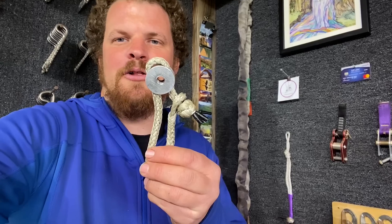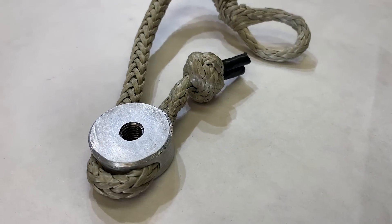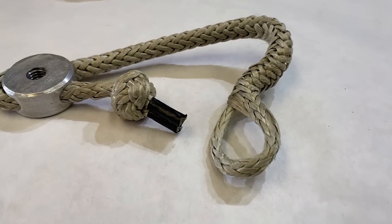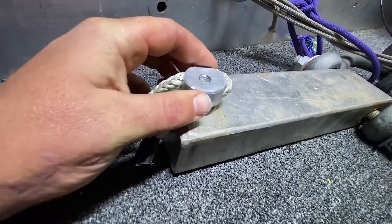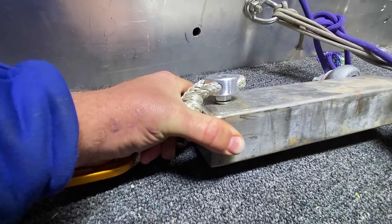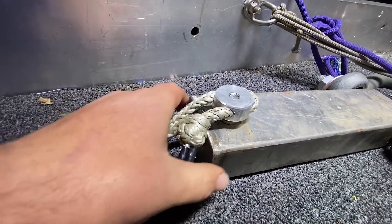So those were the climbing technology caving anchorages — soft anchors. A viewer sent us an alternative. Those of you who have been watching a long time will recognize this as one of Ryan's favorite things. It looks like it is a round aluminum round stock that has been bored out and threaded. So let's see what these break at. We have it screwed into a bolt — it is threaded, and that's a spacer because this wouldn't thread all the way down and there's nothing really to grip. If I was designing it, I'd probably remove the threads from this and just screw a nut down on top of it like a traditional hanger.